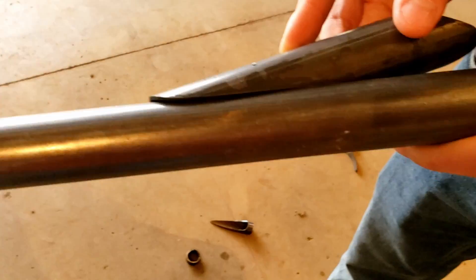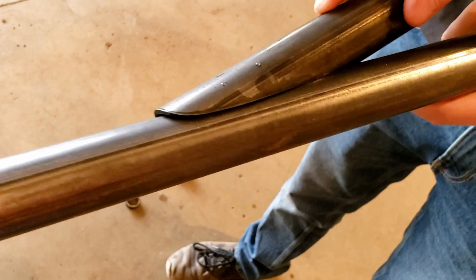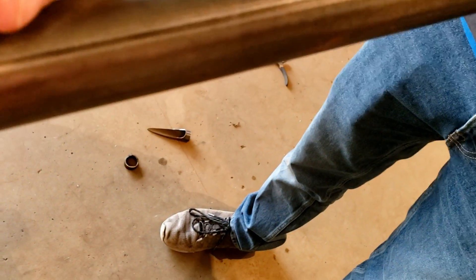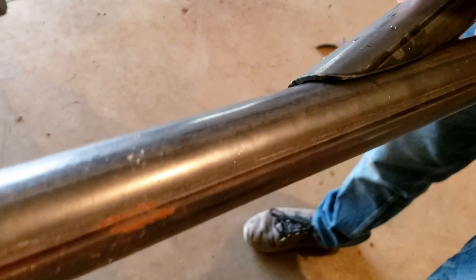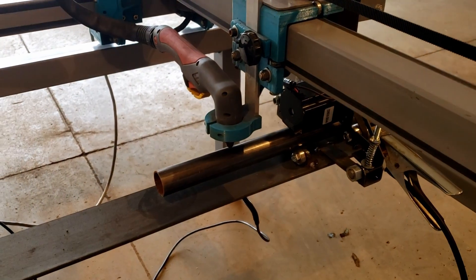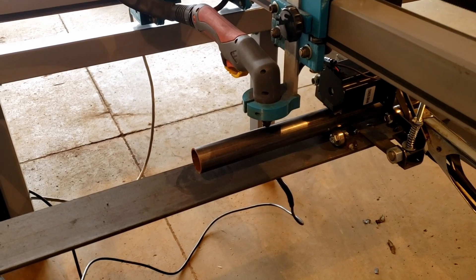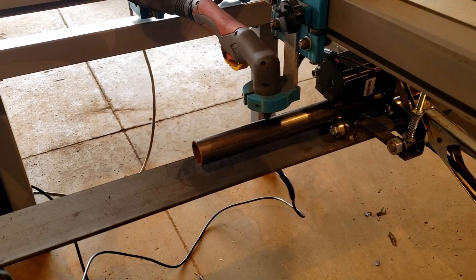We pulled out the 15-degree notch and lined it up — take a look: a nice, beautiful cut. We had to run it under water for a second, it was a little too hot. That gives you a great option you could never get on a hole saw, and we've even got a little bit of a gap in here for running a bead — the way the bevel is cut. No grinding, no finishing — it's just a perfect notch. Another advantage of this rotary axis is we can complete a whole tube. In this case we're doing a very short tube — something you couldn't fit in a tube notcher — with a 90 on one end and a 45 on the other, less than 5 inches long.